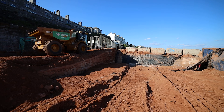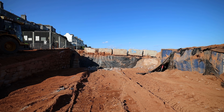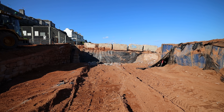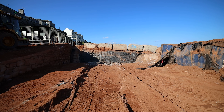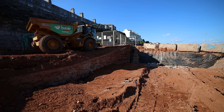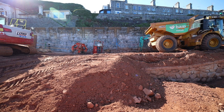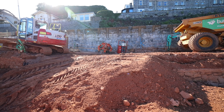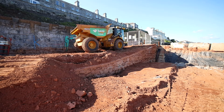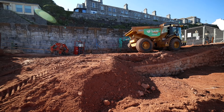In the ground here there are concrete piles. What we do is break the piles back down to the cutoff level and then start building up from the ground with blocks — it's all a blocked modular system over here. We've also got staired access down to the beach. As part of this scheme we're removing the dip which is currently here, so you'll have a staircase running up where the excavator is, and then the promenade will carry straight through onto the promenade on the opposite side. It'll stay at pretty much the same level all the way through.